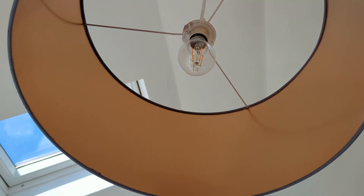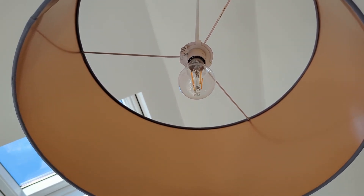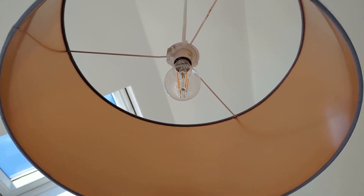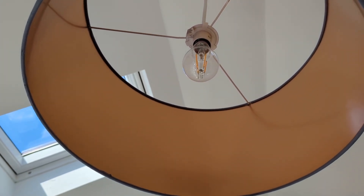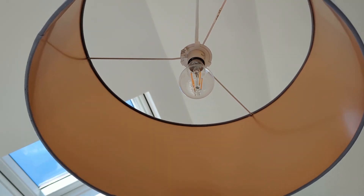Not all LED bulbs are a problem. These cheap Chinese LED filament lamps — my electrician assured me they'd only last a week, but they're years and years old now — I've got them all over the house and they don't cause any interference at all. I can highly recommend them. Similarly, I have one MK socket with USB outputs and it doesn't really cause any interference, though I'm told many such sockets do, so it may be worth choosing an MK brand if you need one.